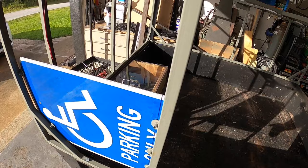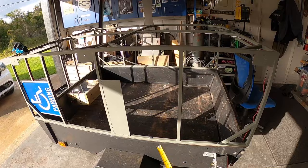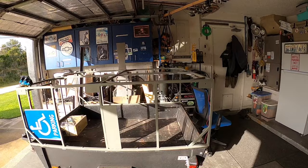So what is the next step? Well, next step's real simple. We need to go ahead and get this entire structure lined with aluminum, get that closed in so we can start on the roof rack and be able to set the rooftop tent on. Now, if you remember back when we built this, I wanted this entire thing to be just under 24 inches, so our inside height was about 36. If you look here, we are right about 23 3/4, which gives us a nice little 1/4 inch buffer zone, so we should be a-okay. Basically, enough jibber jabber. Let's get to building this thing.